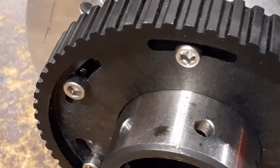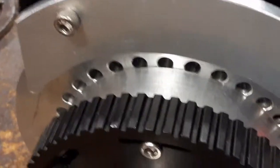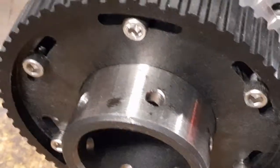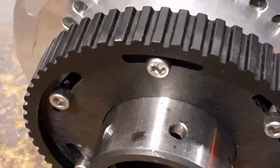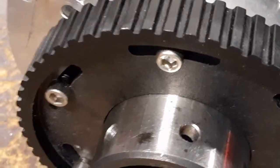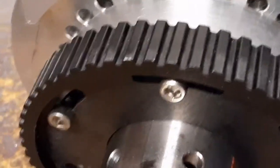I couldn't do this if I didn't have the brake unit on, because the brake is what actually locks the spindle — all the tooth belt does is rotate it in a free state.